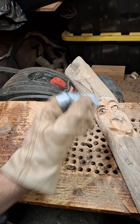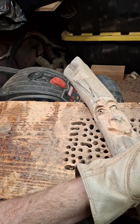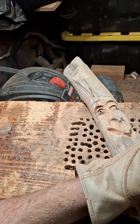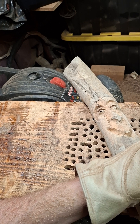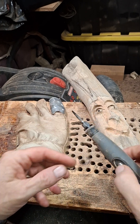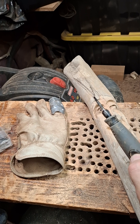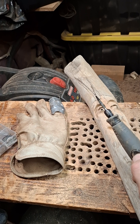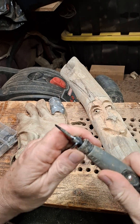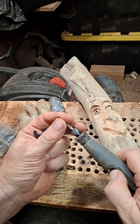Okay, let me put on a sanding burr — well, not a burr, but a sander. When you use a sander you want it way low. I put mine at about 10,000 RPMs, because if you go up to 25,000 or 35,000 with a sander it stresses out your Dremel real bad. I've actually blown up a Dremel before by doing that — I didn't know better.